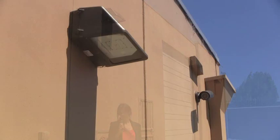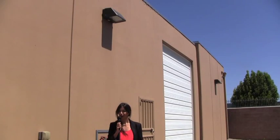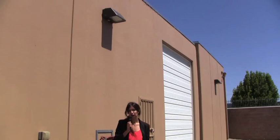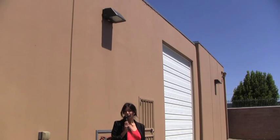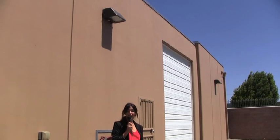These are great for security lighting. You have much better visibility. They're only 44 watts and replace 175 watt HID. They're about 3,000 lumens or so, plus or minus, and it's way more light than you would get from 175 watt high pressure sodium.